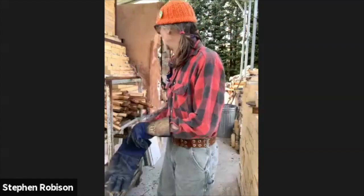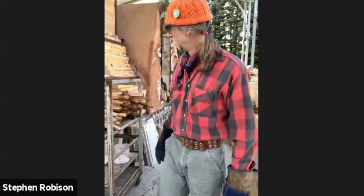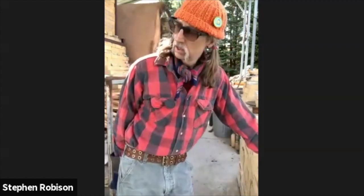But yeah, this is the third day, and I can't remember when I hit cone 9 going down, like after 13 hours, 14 hours. So it's just been holding and sticky. What's cool is it's sticky, and you hold it at that temperature, and all the ash that's going through there just sticks to it instead of flying out the chimney. Instead of moving through. Yep.